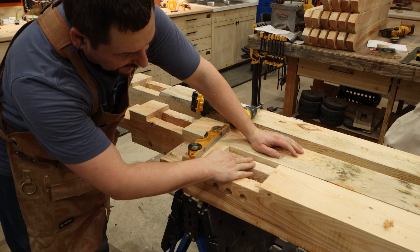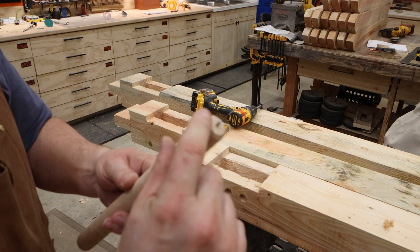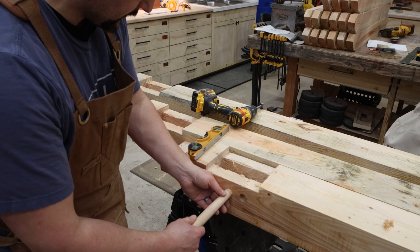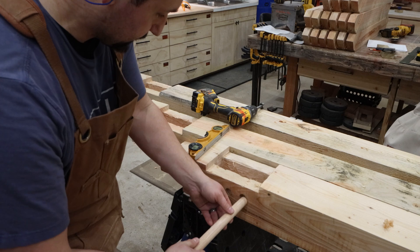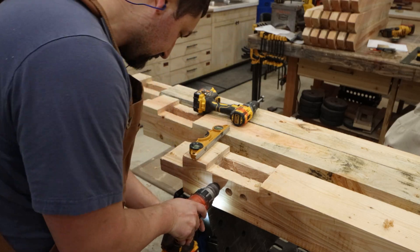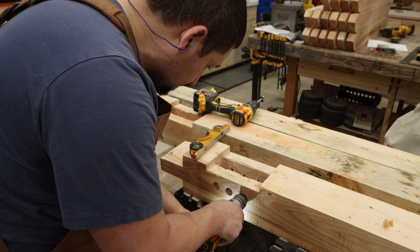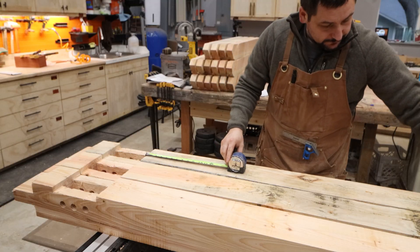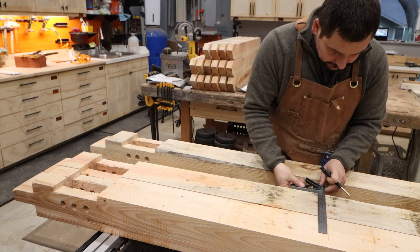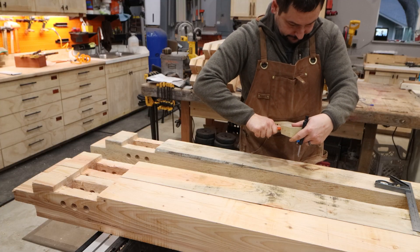In order to make sure that the hole from this side is exactly in line with the hole on the other side, I've taken a wooden dowel and put a screw in the tip of it. That allows me to slide this in here and it snugs up in the hole. We tap it and it leaves a mark where the hole needs to go. Then rinse and repeat three different times, and start a layout. These are done the same way based on the center of the beam, or post in this specific case.